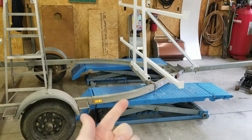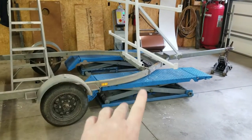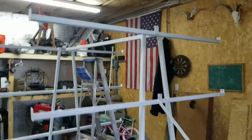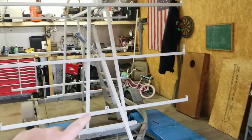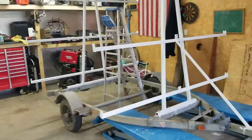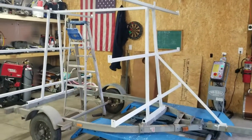Here it is almost finished. I did make a couple changes — on the bottom I had 14 inches instead of the eight inches I talked about earlier, but it made it way too high. I wouldn't be able to get a canoe in and out with the top rack as high as it was, so now it's eight inches from the bottom to the first rack, which makes it more manageable and easier to load. It's in white primer right now. In the past it bounced really badly, so I put a cross member here going to the tongue, which stops the bouncing considerably. We're going to paint it black a little bit later and this will be a complete project. If you have any questions leave me a message, and thanks for watching — if this helps please subscribe.